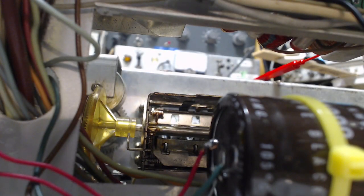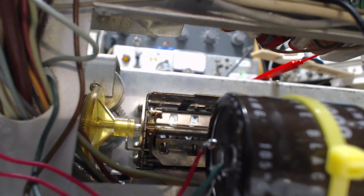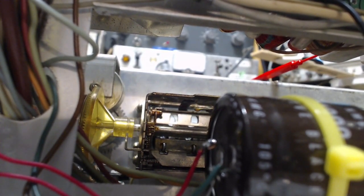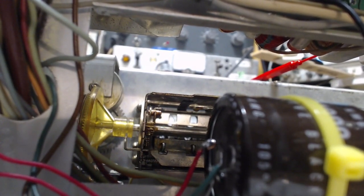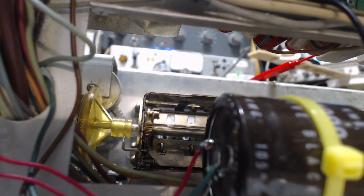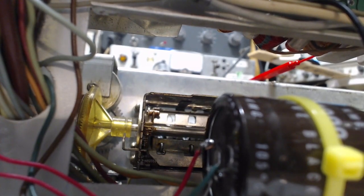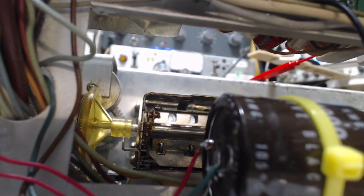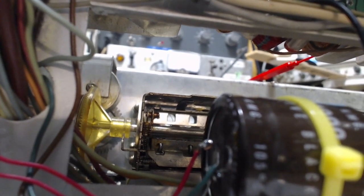Well, if I think about slipping strings, a lot of radios can have trouble with slipping strings. That can be because the demand on the string is too much because of bad lubrication in the mechanism that the string is trying to drive. It's got too much work to do, and the string will slip, usually over the tuning knob where the string wraps around it. This one is 100% gear driven, except just on the outside here, and these strings are not involved in any way with what's going on.